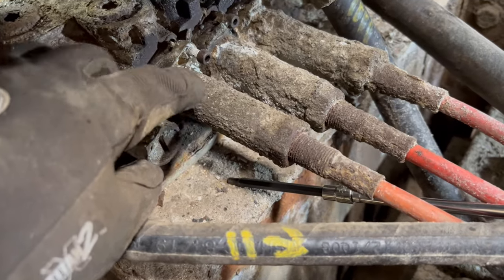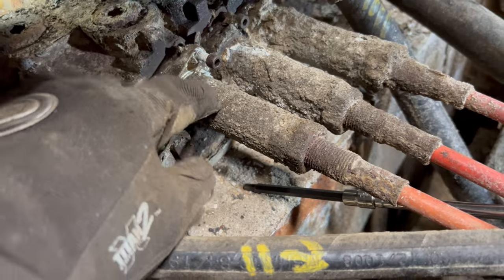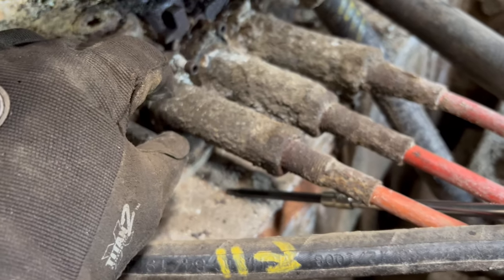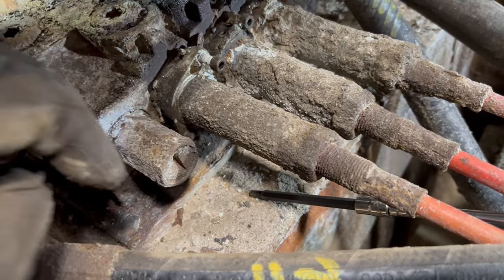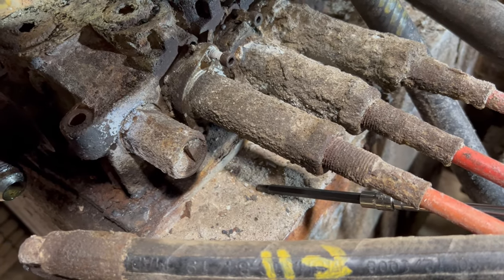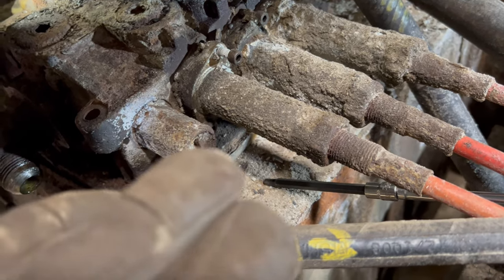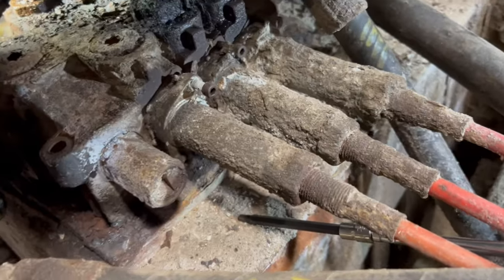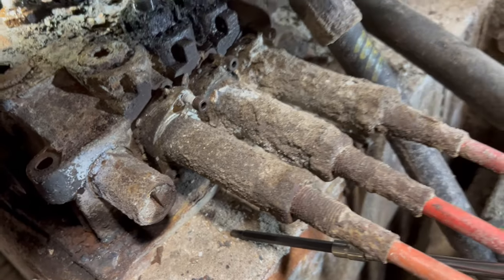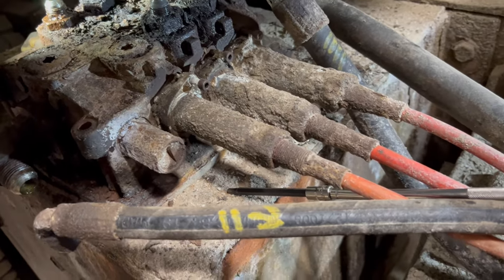And then underneath there'll be a pin on like a little fork that goes over the valve, the end of the spool, and so it kind of forks around there with like a clevis, and a pin goes through, and either a hairpin clip or a cotter pin goes in the bottom. I think it's a cotter pin, but I don't remember. But like I said, I gotta get them off first, and then we'll have the valve free.